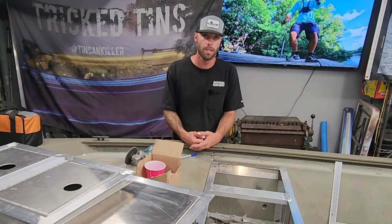But if you're not going to weld them, you could just come back and put a little angle clip in this corner right here, rivet it into here and down through here. Same thing on the side. It's very simple. Before I put this bottom angle in here, I just took a framing square and ran it here. That way I knew where to put that bottom angle in, shoot your rivets in, put 3 or 4 supports in there, and then this face sheet. This face sheet is about 59 inches from here across at the top and 49 at the bottom. I'm going to send you this piece.